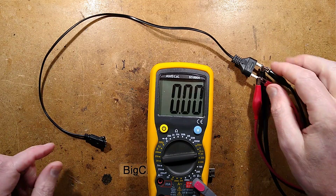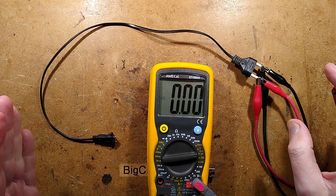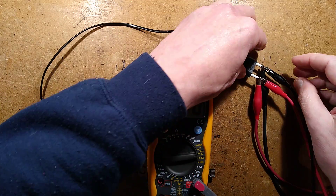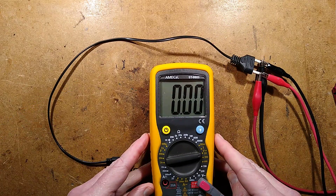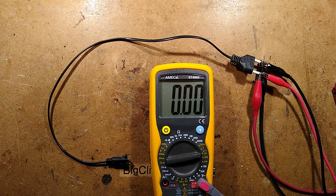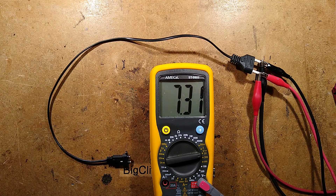I'm going to apply five amps through it. I've put a shorting link over the end and I'll measure the voltage across it to see what happens to the cable. So there's now five amps flowing — and it's a surprisingly high voltage drop of six volts across it, and that is increasing, going up as the cable heats up.